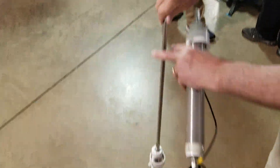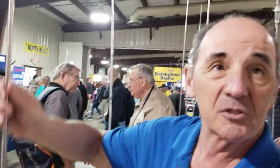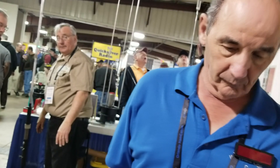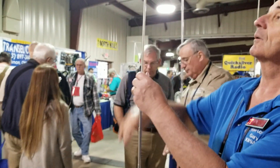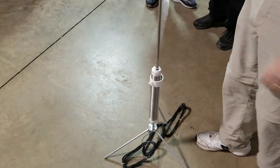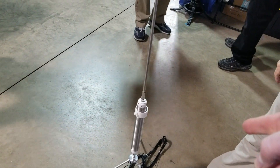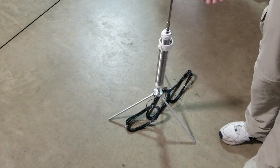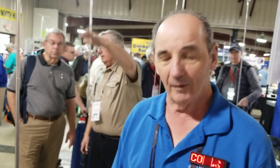When you extend it in the back of the house, nobody can see it from the front of the house. You can take the whip off, take the legs off, and carry it in a backpack if you want to. That's just a wonderful antenna. My brother also made some additional radials for his. We use three radials — that's the minimum I tell people. More is better. I've done it up to 20 radials.